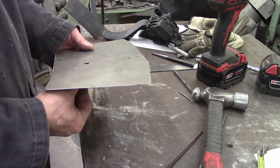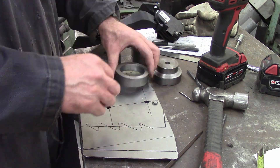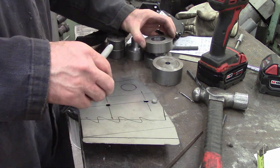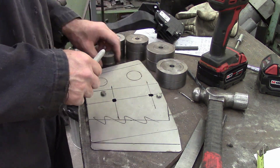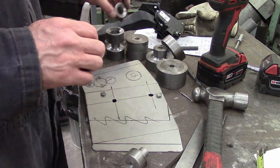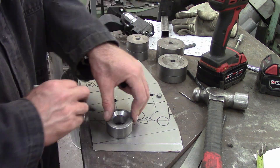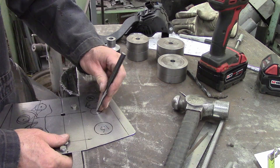An interesting note, and this is a little bit of foreshadowing: while this pedal is from, let's say, an '06 Chevy truck, the '07 Chevy van that my computer came from will not talk to anything but an '07 Chevy van pedal and an '07 Chevy van throttle actuator module. I got a book on LS swaps and it says these are all kind of interchangeable - no, they're not. The van computer will not talk to an '08 van pedal, or an '06, or anything else. So if you're getting stuff to do a swap, get exactly the year and model for the computer that you have. You're going to be happier with that.